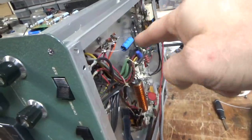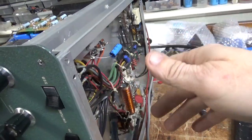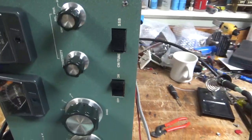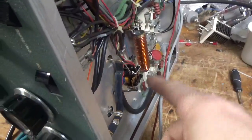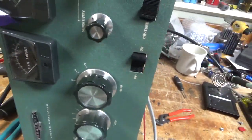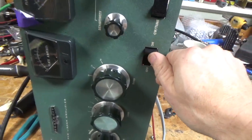I put the temporary capacitor in — I will end up using that cap, but just tagged in there temporarily in case it did not work out right. I checked the coil resistance to make sure the coil was not open first. That is one of the things I always check when I get one in. So I am going to turn it on.